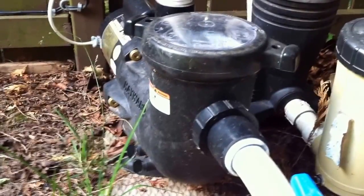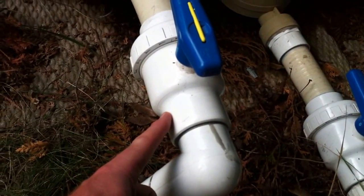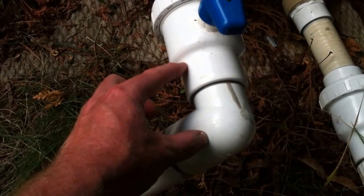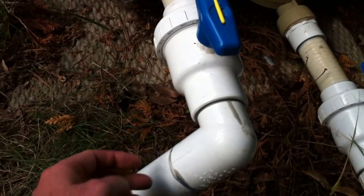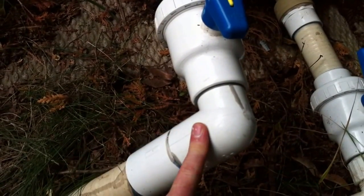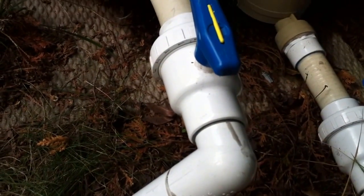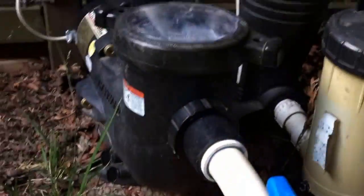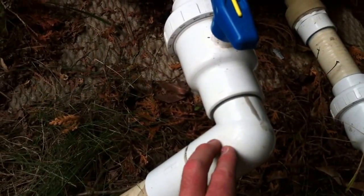The long-term effects are that it's likely to incrementally reduce the longevity of your pump. The more problems like that you have, the harder your pump's going to be working. Guys use street elbows because there's a slip connection on this valve, and instead of putting in a close connector piece and a traditional sweep 90, it's a couple of extra cuts. It's just faster — glue that spigot right into the inch and a half slip port and you're good to go. The service technician probably knows this isn't going to immediately cause a problem, and if you got one year less life out of the pump as a result, that's not really his concern. That's why you see stuff like this — it's just easier for them.